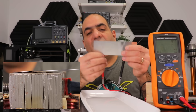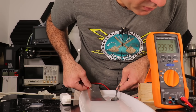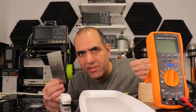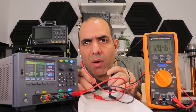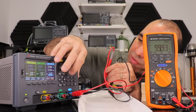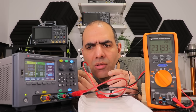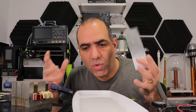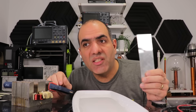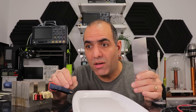I think I know the reason why. You remember how little the aluminum sheet moved, and its resistance is well under 1 ohm. The resistance of the salt water is like... minus 2 megaohms? I think I made a battery. Running a constant 10 milliamps through the water, the voltage across it is about 1.2–1.3 volts — around 130 ohms. If I raise the current to 0.1 amps, it's almost 2.3 volts — like 23 ohms. The resistance of the water is not linear. The transformer creates the same EMF across both, but the resistance of the salt water is hundreds or thousands of times larger than the aluminum sheet, so much smaller eddy currents are created and almost no effect.